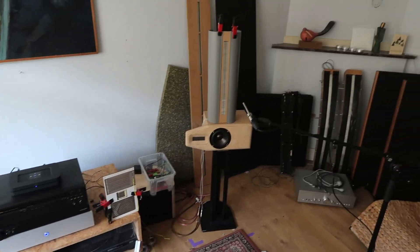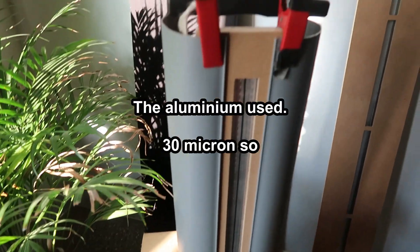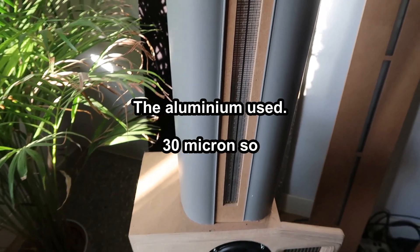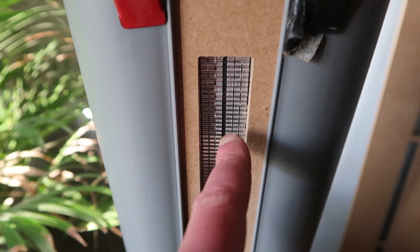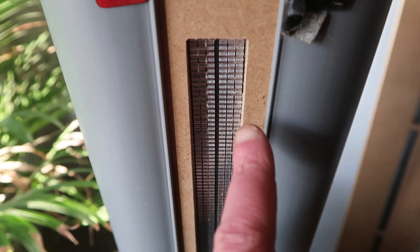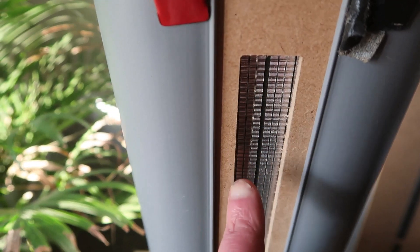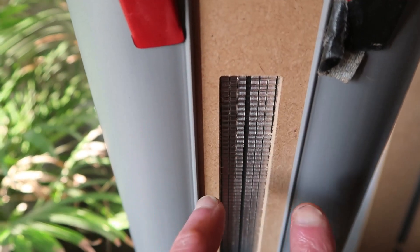They are 86 to 86.5 dB, so that's good - there's much to gain. The foil itself is a bit heavy; I think it drops off at the upper range and could be a little bit better, so maybe thinner foil. I wish to close this gap a little bit - not so much because of looks but it helps. I'm not sure how much you have to cover here, so this piece of wood is sitting just on the edge of what is actually playing or driven, and behind the wood there is still a piece that is not driven.